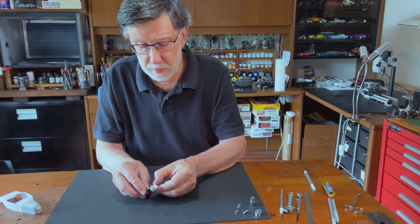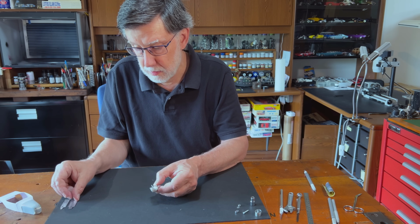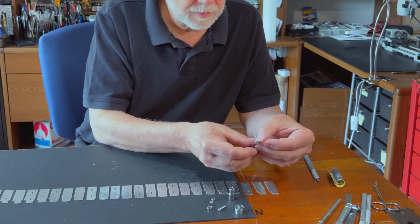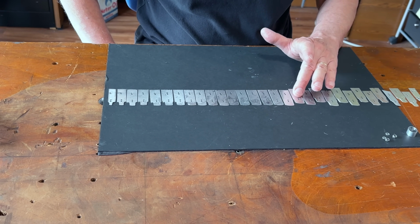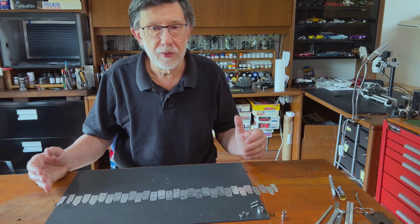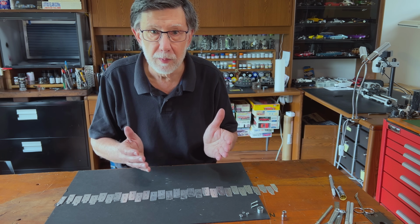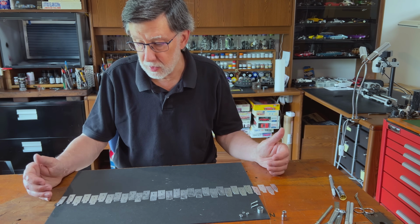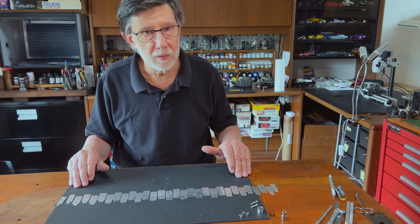It's super important at this point to lay these down in the proper orientation and in the proper order. I'm staggering these so I can pre-visualize which ones will be grill bars and which ones will be recessed and in essence invisible. I have an even number of pieces here because that is the volume that fit in the collar. If you have an odd number, then you can choose whether your middle piece is visible or not. That middle piece could be the one that's forward, creating a center bar, and the two on the ends would match, whether they're both in or both out. The stagger of my two end pieces doesn't match because I have an even number. One's in, one's out. So I'm going to start stacking, and I'll make that decision when I get to the end, whether we keep that piece or not.